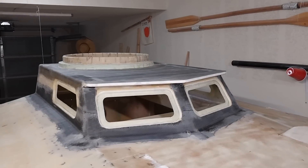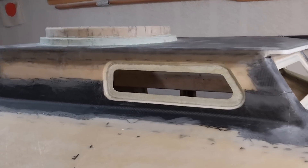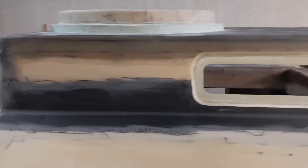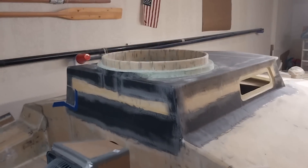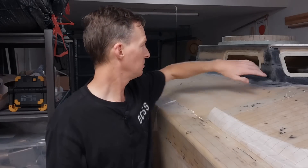I attached it with three layers of carbon fiber. I wanted to use carbon fiber not only because it'll block UV from degrading any of the fiberglass, but it's also lighter and adds more strength than regular fiberglass. It does as a downside block some radio signals and GPS, but so much of the deck is not going to have carbon fiber and you've got the deadlights here — I'm sure any signals I need can sneak out or in.